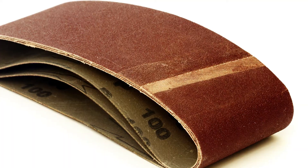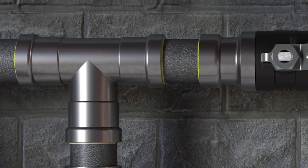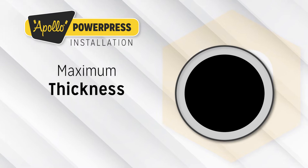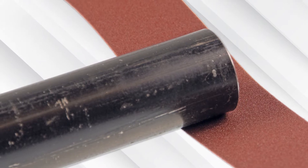When using painted black and lacquered iron pipe, the pipe should be inspected for excessive paint runs. If runs exist, the surface should be smoothed using fine grit sandpaper and wiped clean before installation. Epoxy coatings on black steel pipe have the tendency to increase the outer dimension of the pipe. The thickness of the coating should be kept to a minimum, with a maximum allowed thickness of 0.0118 inches. If the coating exceeds this, the pipe can be sanded, but the surface must be smooth.